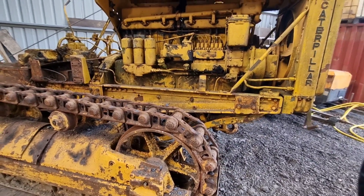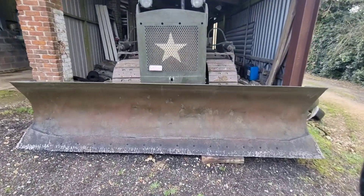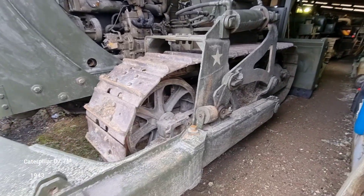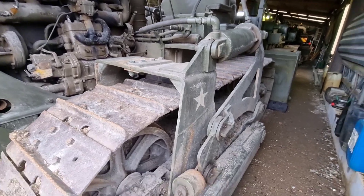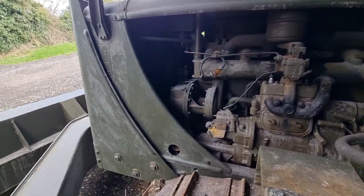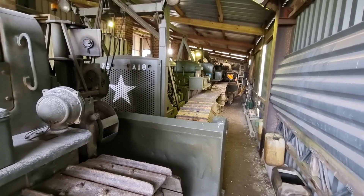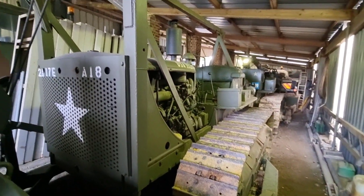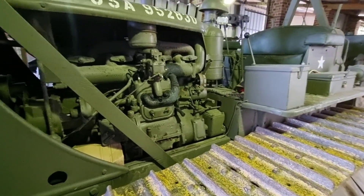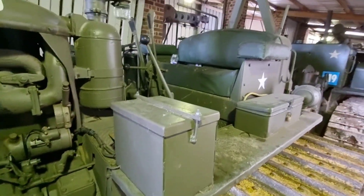We'll show you what these tracks need to go on — the other D8. We've got some other D7s in here. This is a D7 7M, 1943 — it's all restored. Normally it starts on the button but it has its days. Six-volt starter motor on the donkey engine. Quite a nice machine to operate — over-the-gantry, cable-operated. And this one's a 4T, 1944 D7 — exactly the same configuration really. Six-volt starter, still uses a crank handle on the top. Big bench seat.